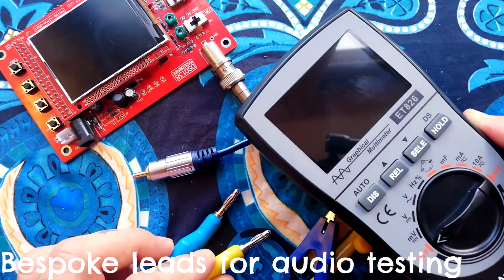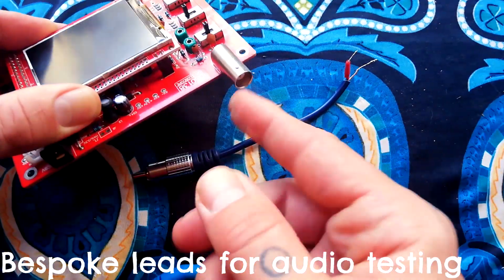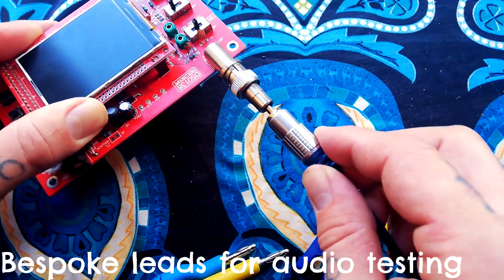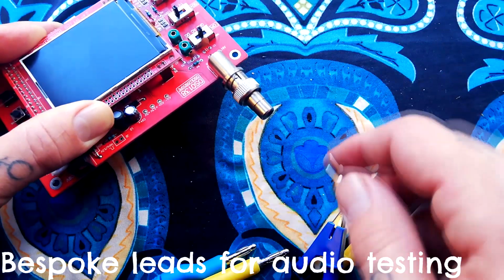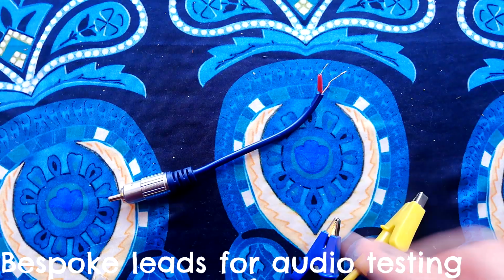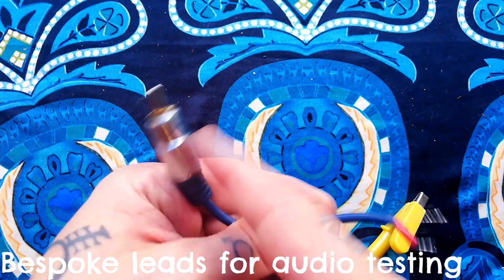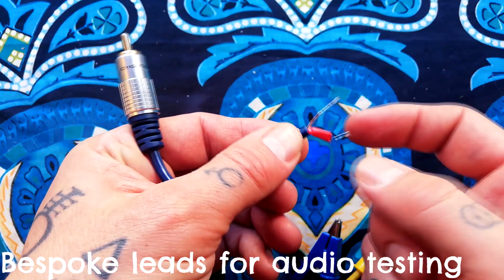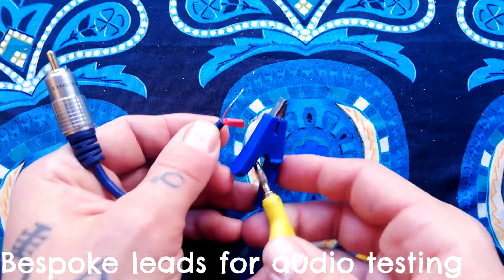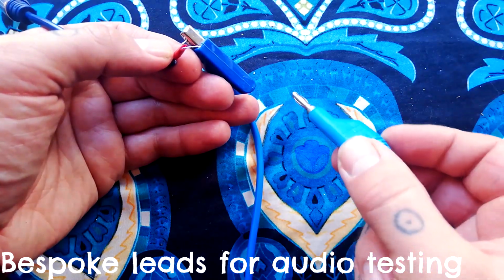Imagining that the oscilloscope in this guy had worked better, another relative disadvantage compared to using this is this has got a BNC socket, but you can get these BNC to RCA adapters pretty easily. That means you can just plug an RCA to RCA cable from the tape out of a Portastudio into this. Whereas in order to measure frequency using a multimeter, I had to fashion this. It only took me 5 minutes, but basically I've chopped an RCA to RCA cable and stripped it, and I've got the positive and negative wires exposed, and I've tinned them with solder, and then you attach a crocodile clip at one end and the banana plug into the meter at the other end.